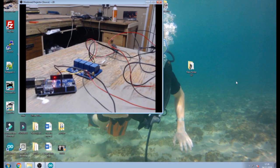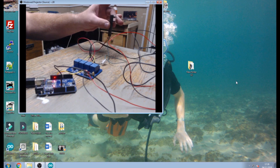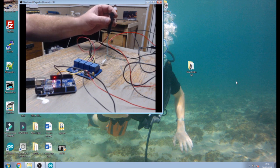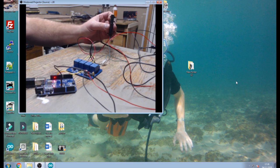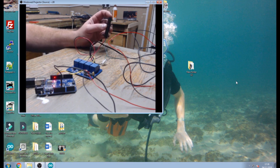Hello, welcome everybody back to one of my Benton Valley Model Railway demonstrations. Today I'm going to be doing a quick demonstration on a point motor turner, a Peco PL11, which is one of these over here. Someone asked me about whether we could run the Arduinos through the servo code that I have been doing to control one of these via the JMRI and the CMRI communication, and we can, but we do need to change the Arduino code and it does work pretty well.